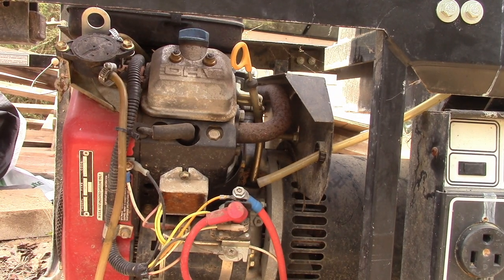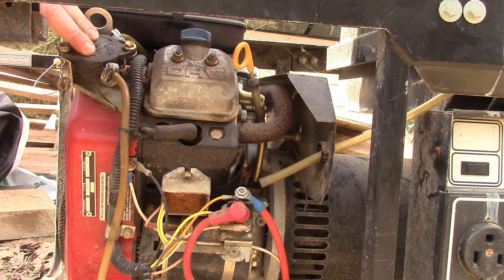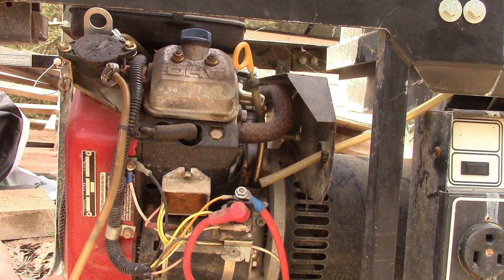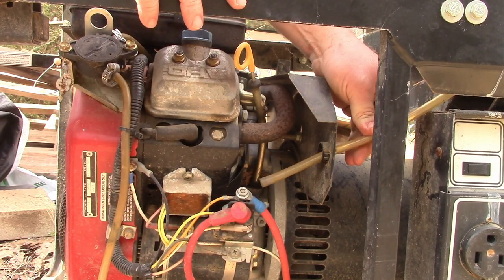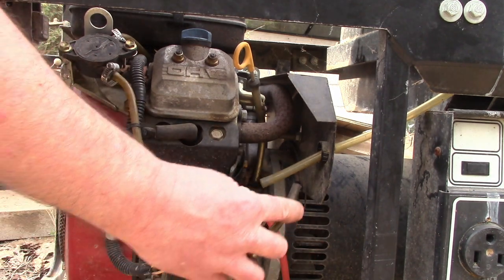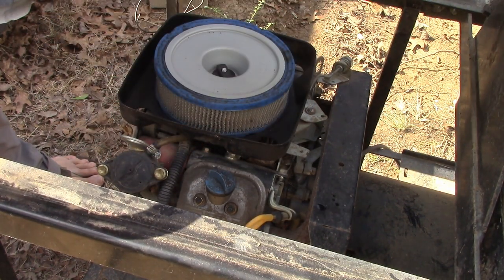So when I got my hands on it, all the rubber was rotten off and the diaphragm and the fuel pump was busted. So I stole a fuel pump from a different mower. This is a couple years ago now though. I'm gonna have to test it, see if it's still good or not. But then I didn't have any fuel lines, so I put on these silicone hoses and they've all gotten real hard. So definitely need to replace all that with some real fuel line. I need a filter, looks like I've lost the filter or stole it for a different project. Well, let's get under here and get where we can disconnect this old fuel line from the carburetor.